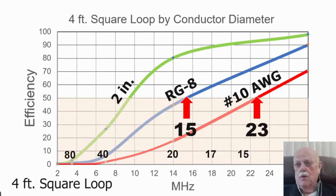Any time you look at a loop — even that MFJ loop — if it doesn't have that kind of fatness to it, it isn't a good loop. So here's a 40-meter loop, four feet in diameter, made with two-inch pipe. If you want to go to 80 meters and keep this ratio, you're going to have to make an eight-foot loop with four-inch diameter pipe. That's big pipe.